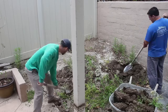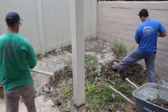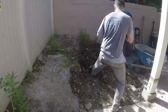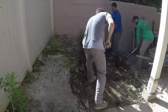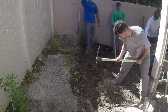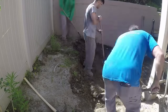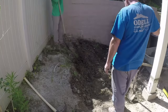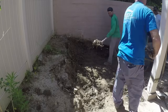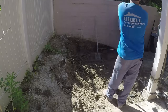We're just going to extend from that existing retaining wall right over to the property line at the same height. The back wall is actually a slump stone; the actual retaining wall is a precision block — they look similar from this viewpoint but they're actually different. There are some trees in the back on the other side in an HOA easement area, and the roots come all the way through under the wall, so we had to cut a few of those out. We also had to cap off a couple of sprinkler lines. We found a buried drain in here, which came in real handy — we were able to adjust the height, put a new grade on it, and use it as a drain pickup for this patio extension.